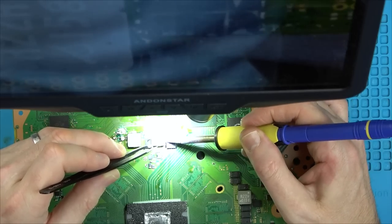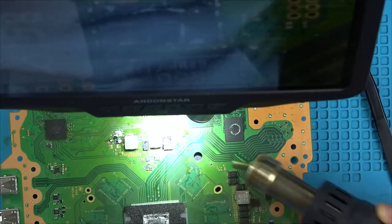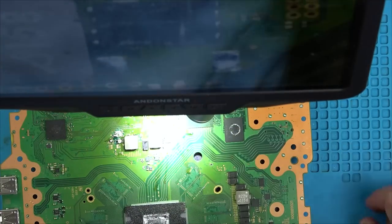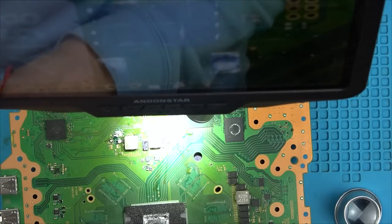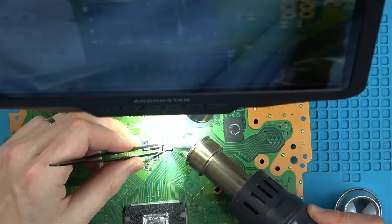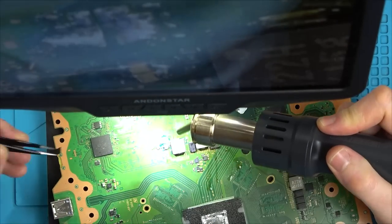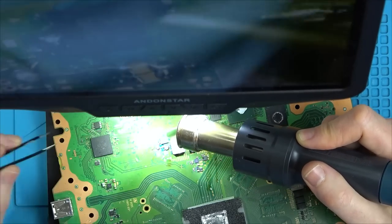Now, I'm not saying it's not going to work though. The interesting thing there is on the two good MOSFETs, the second one on the faulty board and my PlayStation 5, you see that they don't short to that middle pad. All those outer pins do not short to the middle pad, or two of them might have done, I can't remember. But anyway, it's different than the faulty one. But bear that in mind for later in the video. The central pad is shorting on the faulty MOSFET to the outer pins, okay? So some of you will already know what that might possibly mean.